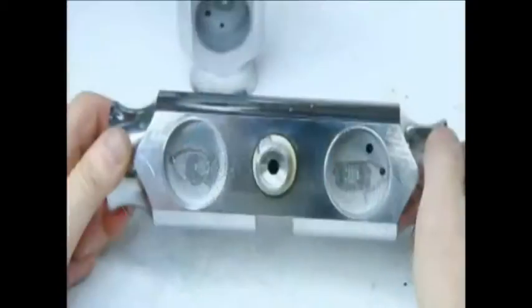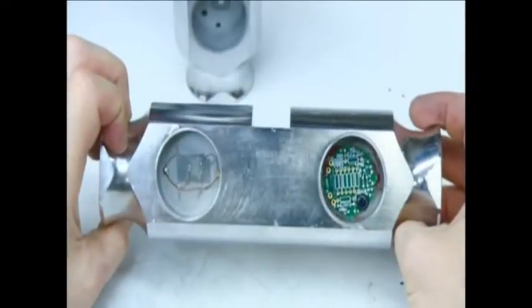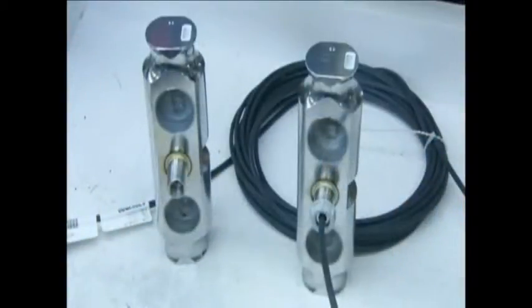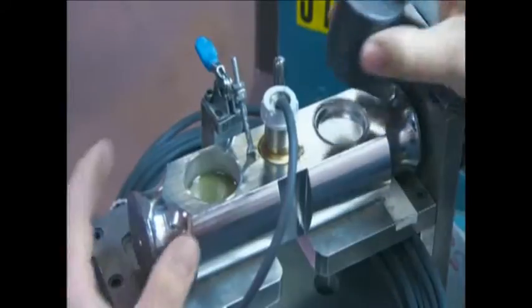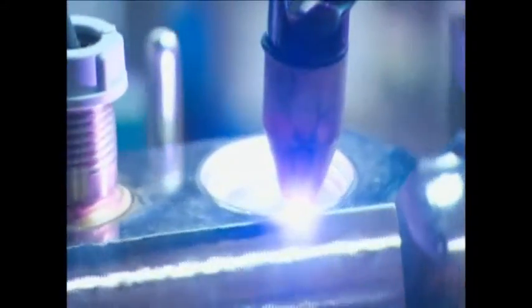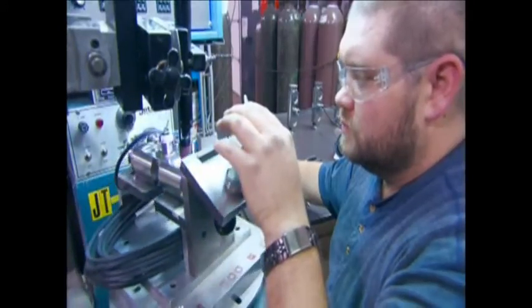Then they solder electrical wiring to each one. The wires all run to a circuit board at one end of the load cell. And from the load cell, wiring runs to the scale's computer readout. The smallest amount of moisture or dirt would cause a strain gauge to malfunction, so they weld a cup over each one to hermetically seal it within the load cell.